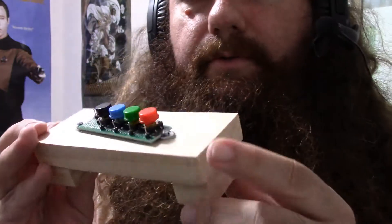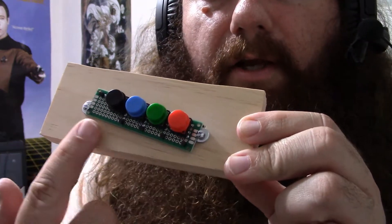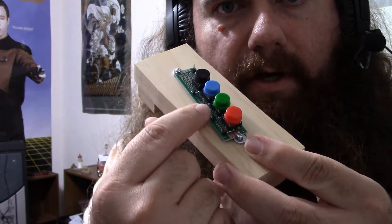The final bit I'll show you — since the soldering is uninteresting — is that under here I use solder bridges to connect them. A solder bridge is just where you melt a bunch of solder along a line, bridging between the dots. It uses a ton of solder, but sometimes it's easier than jumping wires. For long distances you'd want to use a jumper, of course.